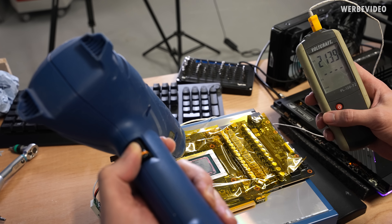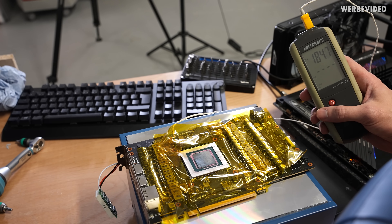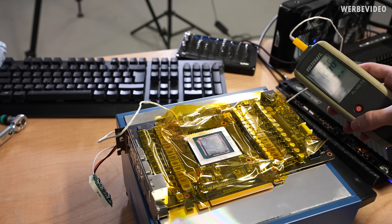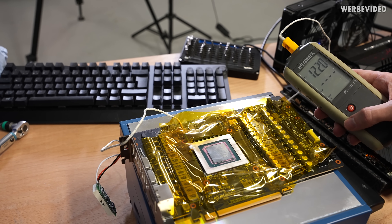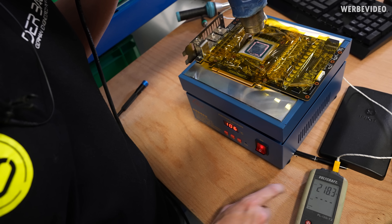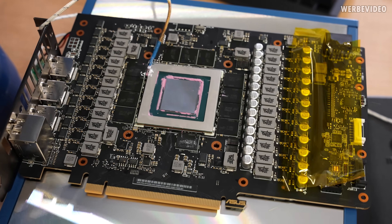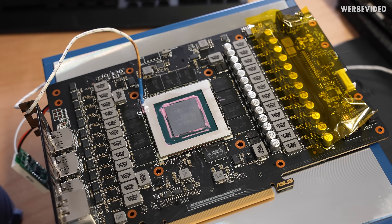Getting close — I'll have to heat it up step by step and wait to see what temperature we actually reach after several minutes. I found a way to attach the probe better, and with about 120°C it definitely needs a bit more heat. Now that it's attached much better, the reading looks realistic. The card is currently at about 140°C — all the flux is gone, so it hopefully moved underneath the GPU. I'll wait about 15 to 20 minutes, assemble the cooler, and see if it helped.